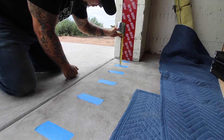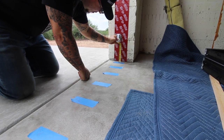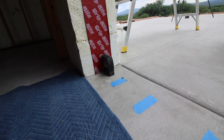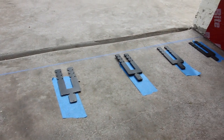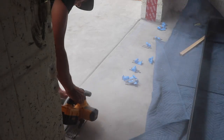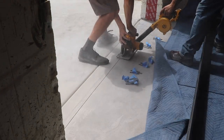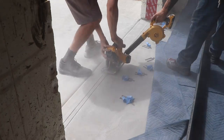The next thing Ramon is doing is ensuring the bottom threshold is perfectly level. He's got his laser set up on the left side, noting on painter's tape how much the threshold needs to come up. One spot is zero — no adjustment needed. He's got to go up a sixteenth on one side and up an eighth of an inch on the farthest side. Those black shims are one-sixteenth thick, so he just layers them out. We also realized a portion of this low-profile threshold is recessed into the concrete, so we had to cut and chisel out a channel for it.